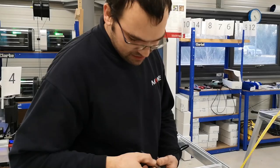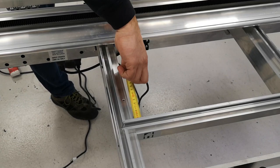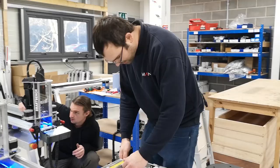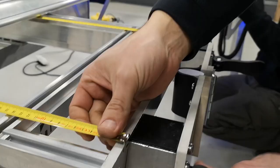The setup is with the Z-Head on one hand and the other end far away. The procedure is similar to Y calibration — slide the tapes under the carriage and extend them fully. The only difference is doing it on both sides. You can put the tape just behind the legs so it doesn't come off.